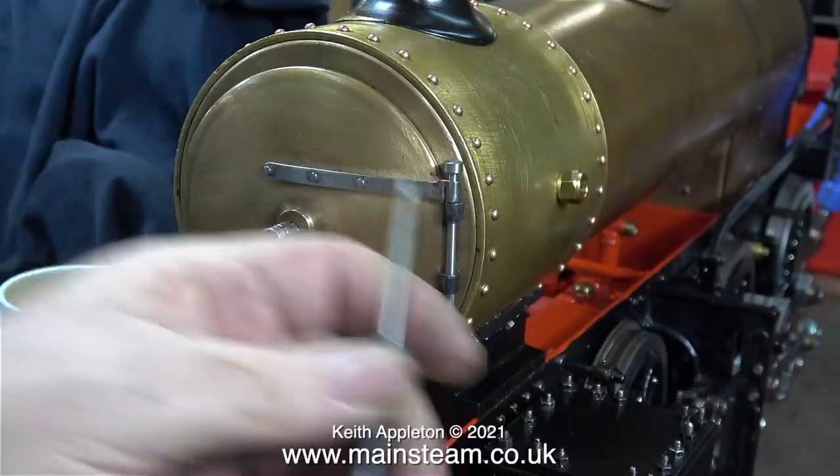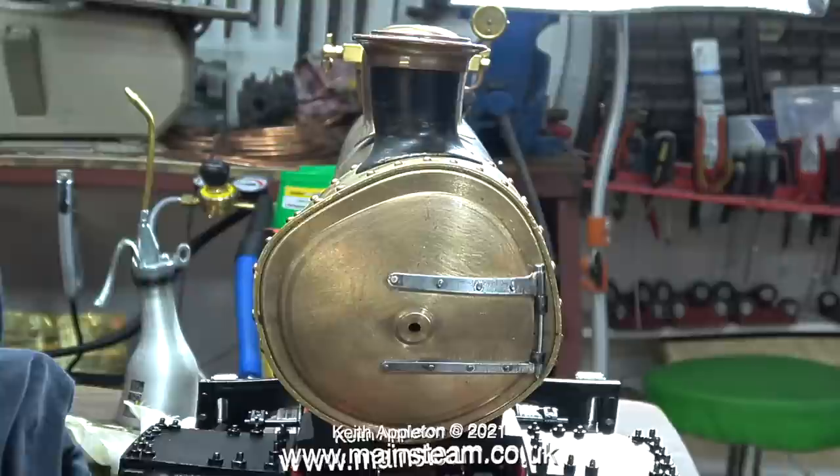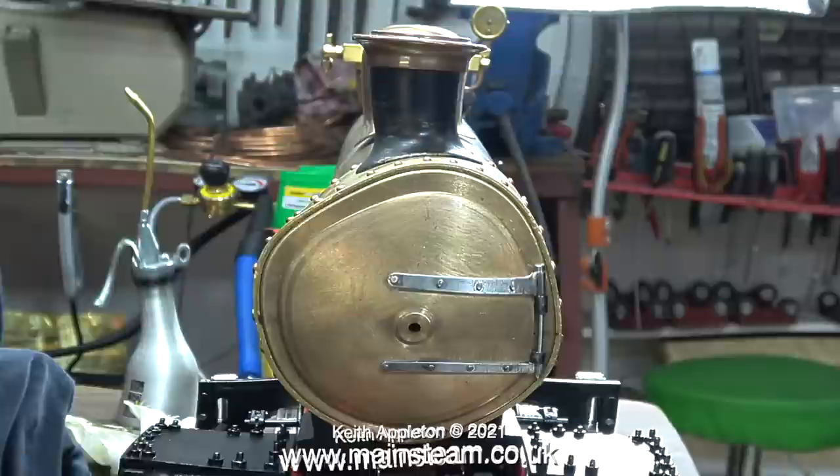Here's the finished pin — it's actually a nice push fit in the top hinge and it is exactly the right length; it doesn't stick out below like the previous one did. The previous one was terrible — an absolute rattle fit — I couldn't live with that. This one is a nice stainless steel pin to hold the smoke box in position.